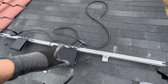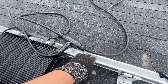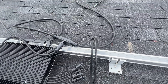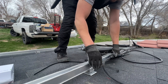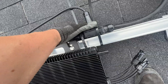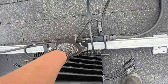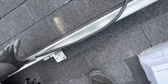One thing is it's kind of big and bulky — it's not necessarily going to fit in a channel rail, and I don't think you'd want that anyway, because if water is building up in there you wouldn't want to submerge this, even though it's water rated, if you didn't get it tightened down enough. So I got some big cable ties and I'm going to test out a way to do wire management with these — pull it snug, a couple of really big heavy-duty cable ties right around this connector, then maybe a smaller one. If you have a channel rail, a lot of people like to put their wires in the rail, but it's not too hard to get it all tucked up. You do have a lot of slack, so this could go to a junction box.